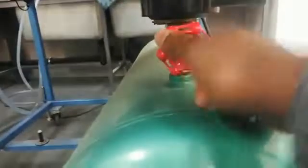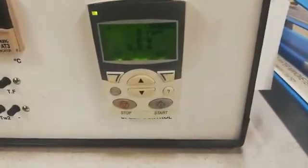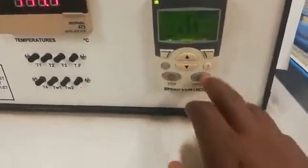To start, you must make sure your air receiver valve is completely closed. Now you can see your circuit breakers. Now if you look on your inverter, it's showing you the RPMs, the watts, and the current. To run your compressor, you press start.